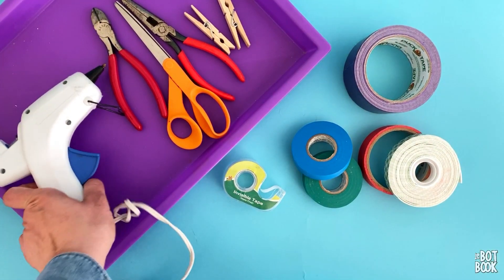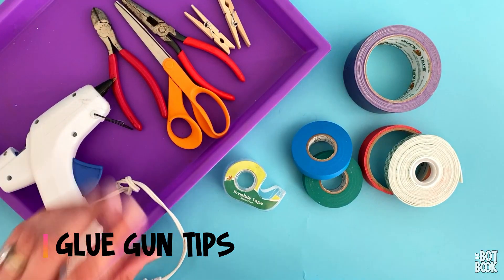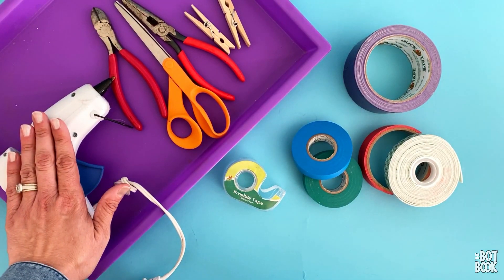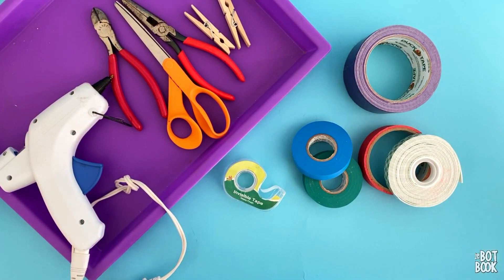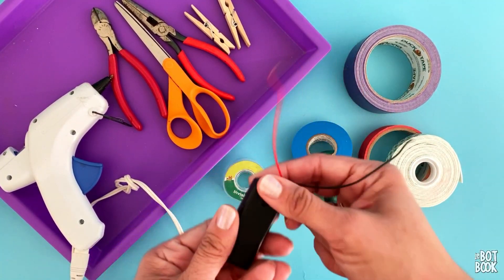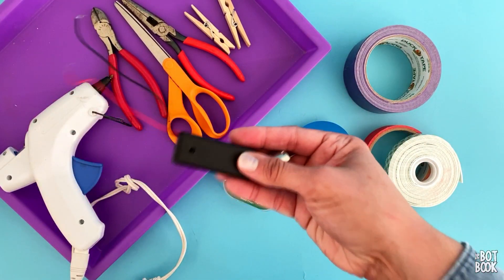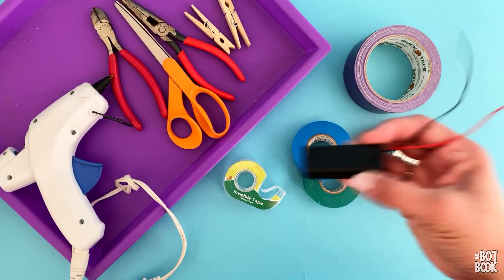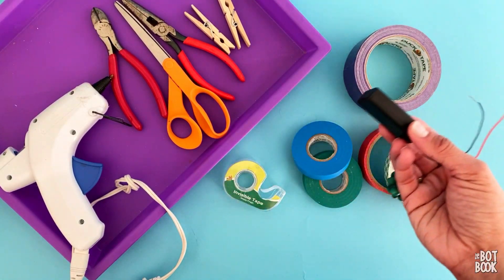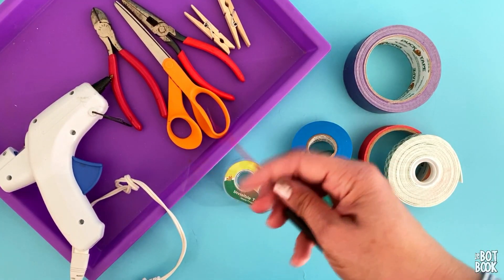You might also want to use a glue gun to glue some parts down. Safety tip: be careful with the hot glue gun. But don't glue down your motor so you can't access your leads, or glue down your battery pack so you can't replace the batteries — you want to be able to access all your connection points. The cool thing about hot glue is you can pop parts off a bot and reuse them, unlike super glue, so just keep those connection points free.